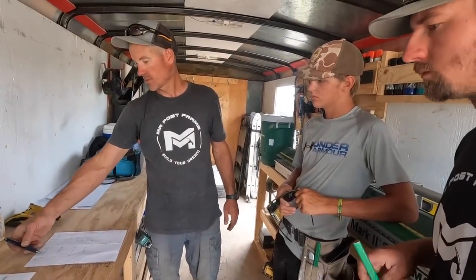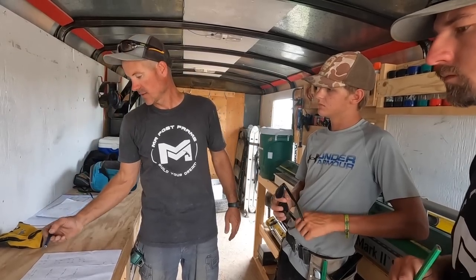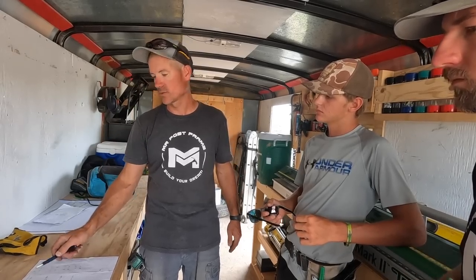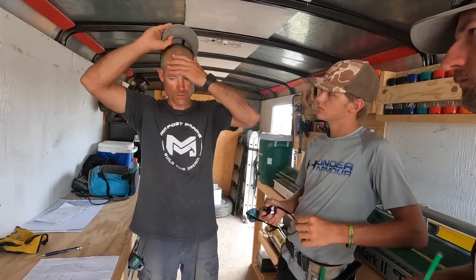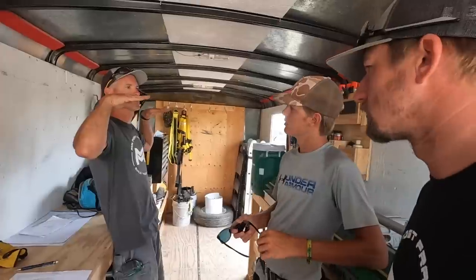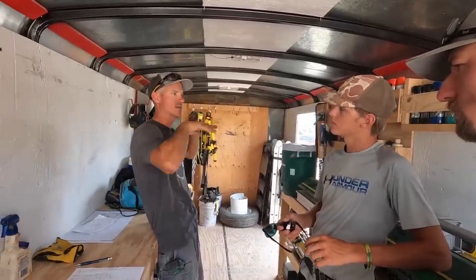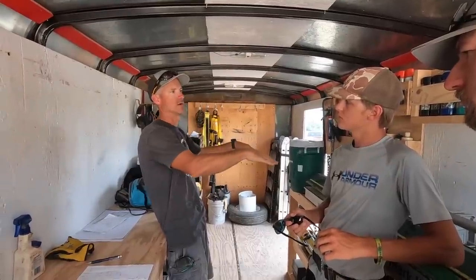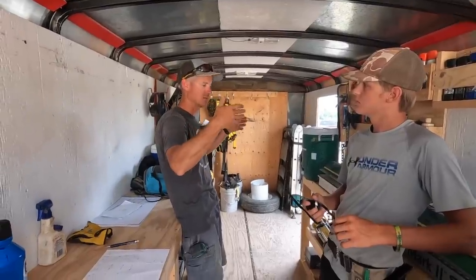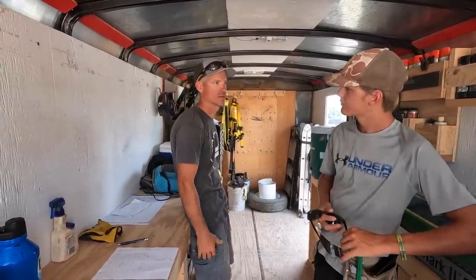So on the width, we always add 3 inches because that's going to be our overlap on each side. And then on these, we cut on one side of each of those, short side is the actual rough opening. Make sense? Mm-hmm. Which end will be the short side, the inside of the house or the outside of the house? The inside, because if you think about it, the long side will create your slope. So if that window ever fails, it'll hit that sill and it'll go out. It's just a slight slope, is all we do on it. So if that window ever fails and water hits it, instead of running down the wall and rotting everything below, it runs out over the tieback and down.